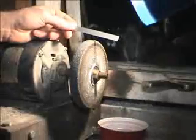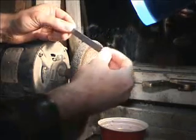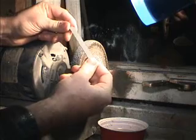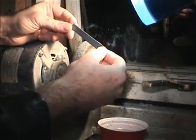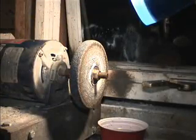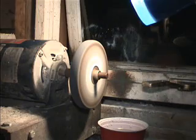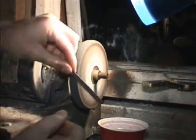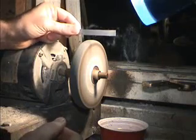So now we're prepared to make a pick blank. Using the piece of cracked off hacksaw blade that we started with earlier in our materials, we're going to start the grinder and make our blank. So we'll get this baby wound up. And away we go. Always remember to quench in water after every few seconds of grinding.